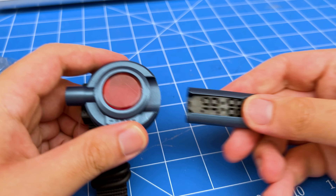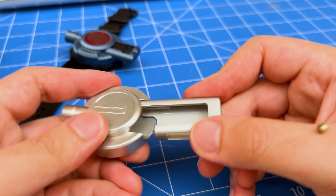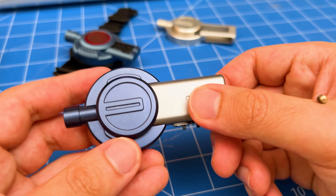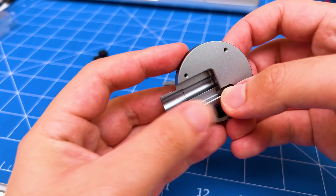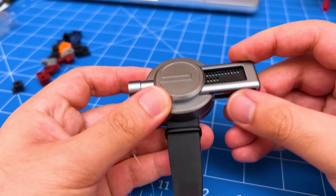Besides this, there were more problems. With 3D printing, parts can easily press fit together. However, metal is much less flexible and forgiving than plastic, so I ran into issues trying to make the cartridge slide in and stay securely. After iterating on a lot of designs, I designed a compliant mechanism with a perfect amount of friction and staying power. But again, this took time. The theme here is that making a product is a lot harder and time consuming than making a one-off project.